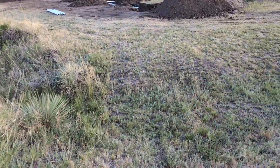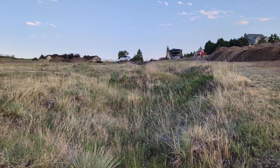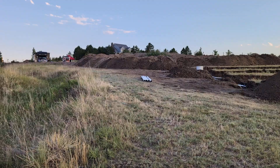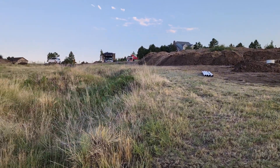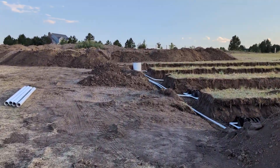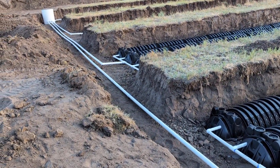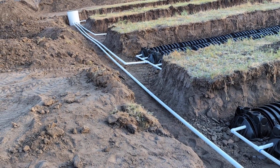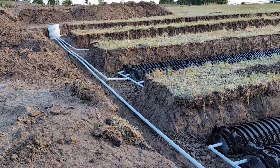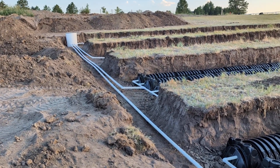Walking through a shallow area of the dry gulch — we'll have to put a culvert and land bridge across to route the effluent pipe as well as the electrical line from the meter and transformer. That will take the pressure effluent line up to that large white riser. The riser has four outputs, one for each bed, using only one at a time. Inside that white riser is the automatic distribution valve, placed there so it's serviceable, replaceable, and inspectable if needed.